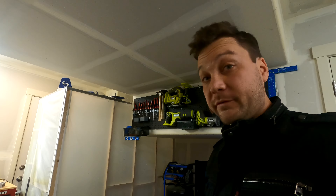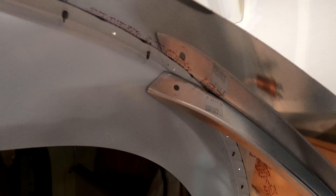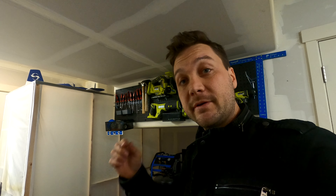I got it on and it was a lot of work, a lot of fine tuning, but I actually had a lot of fun with it. All I used was tin snips and a file, and after probably more than a dozen — maybe even two dozen — on and off rounds of adjustment, it fits great, as you can see. I actually happen to have a spare 6-111, so you can see before and after — not a lot of change. That's why I understand now why so many people had to order a second one when following Van's instruction to 'trim' it to size. That really shouldn't be called trimming — it should be called fine tuning, filing, or grinding.